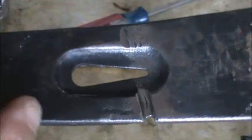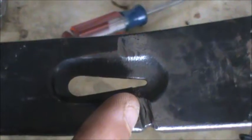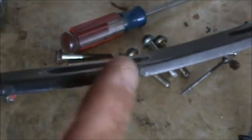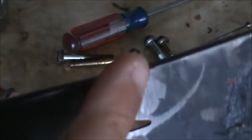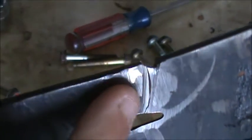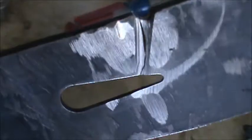Here's a look — you can see the crack real well there. I ground out a fair amount of material, made a ditch. I also made a ditch on the edge because I'm going to fill that in, and I took away some material on the back as well. You can see how the curve almost looks like a fingernail — it's kind of rounded. We're going to fill all this in with weld, then we'll grind it, and that should take care of it.